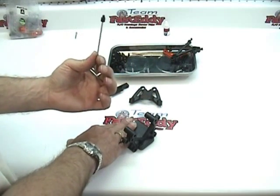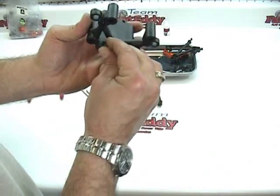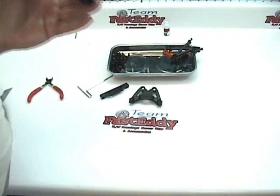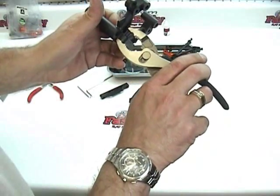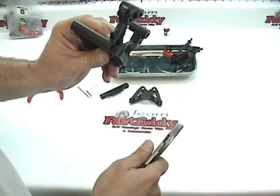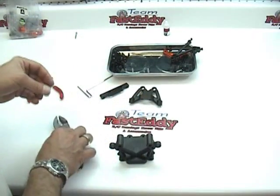That's how you use this tool. The other way to use the tool is with a pair of pliers rather than with an Allen wrench. Same theory — you put your nut on there, get yourself a pair of pliers, and very simply just press the nut in like so. Take the tool out and then go ahead and use it on another nut.